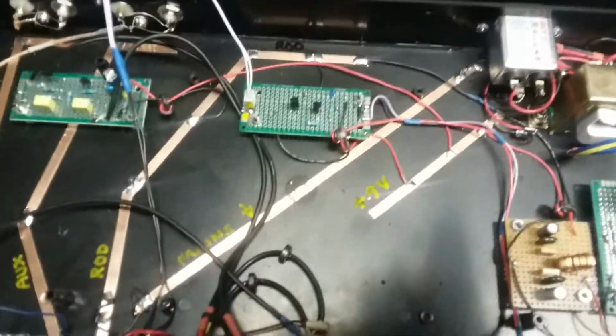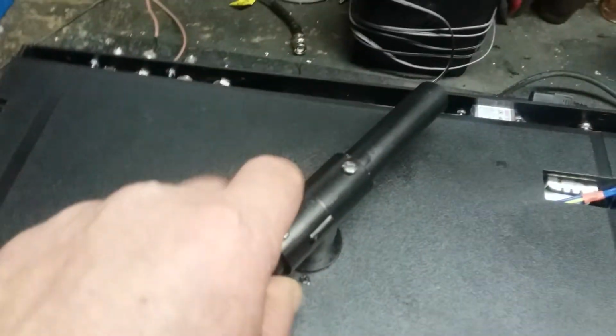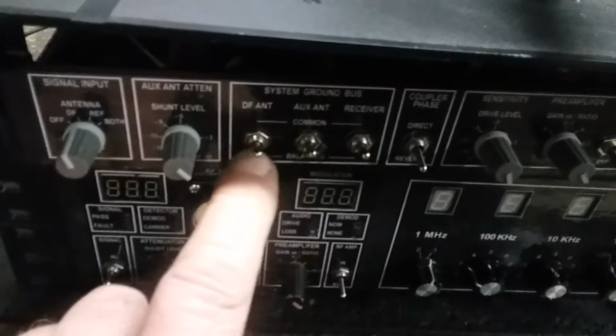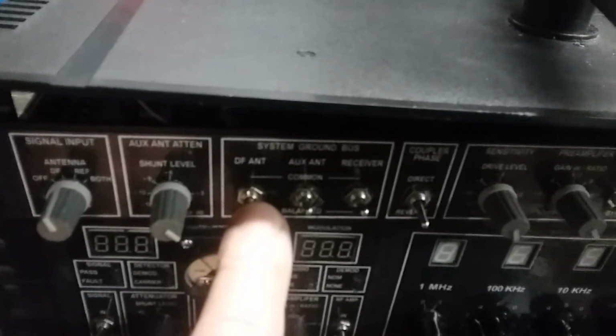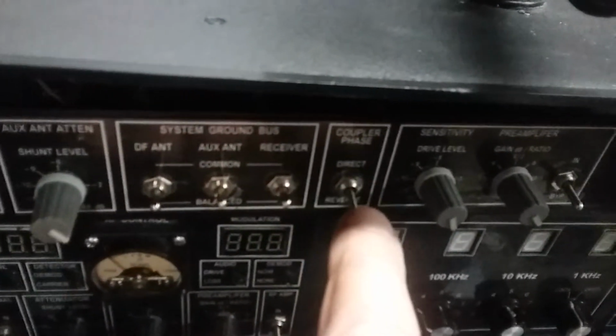And when you're listening to your radio and you've turned this thing around and peaked the signal, and then you come over here and you say, well, it's a little noisy, or maybe it could be louder, you can start playing with the grounds. Bring one side of the pickup coil to ground here, or reverse the polarity of the pickup coil and try it again.